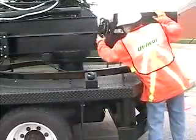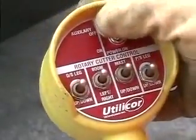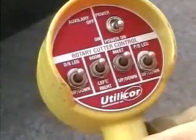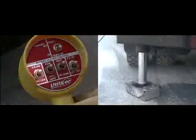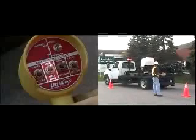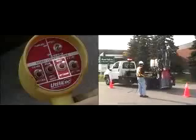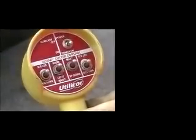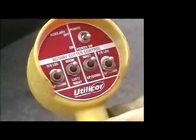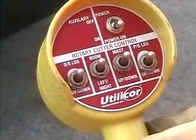Unlatch the coring boom and connect up the yellow rotary cutter control pendant. Toggle switches on this multifunction pendant allow you to turn on the power, deploy the driver's side and passenger side rear stabilizers, swing the coring boom around in a full 270-degree arc, and elevate the coring mast to the upright position. This is a key tool, so make sure that when you put it down, you choose a safe place where it will not be damaged by moving equipment or run over by the truck.